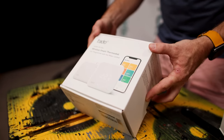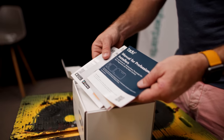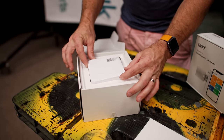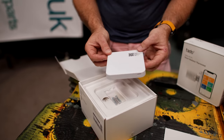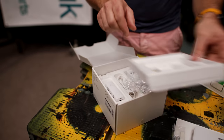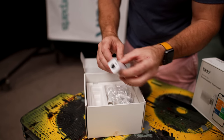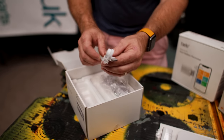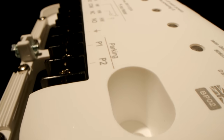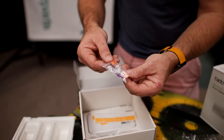For a full zoned system with all of Tado's capabilities, I recommend starting with the wireless smart thermostat. This replaces your room thermostat on the wall and also the programmer in your airing cupboard or loft. Inside the box you'll find the wireless room thermostat with its QR code, small screws for wall mounting, the wireless bridge that connects to your router via Ethernet cable, a USB power supply, a transformer, the wiring center and wireless receiver, wire stickers, and WAGO clips to blank off any redundant wires.